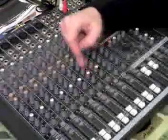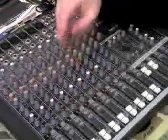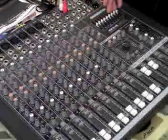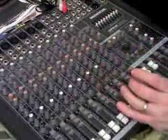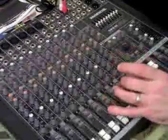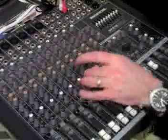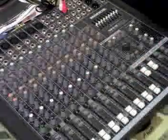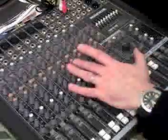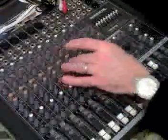What these will also do is assist in eliminating feedback at certain frequencies, as will the 9-band graphic EQ over here. So if you get an awful feedback, you can play with these to try and focus and eliminate which frequency it is that's giving you the feedback and cut it ever so slightly to try and eliminate that feedback. Now again, in layman's terms and very, very simple, these controls are very sensitive. You don't have to move them much to get an effect.